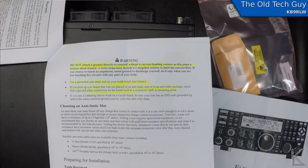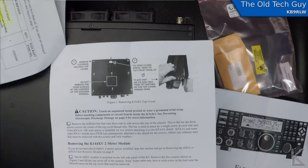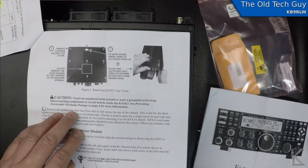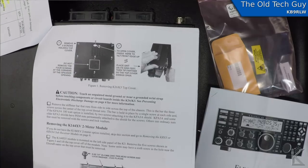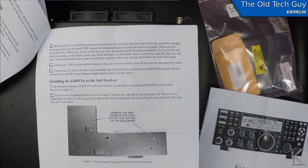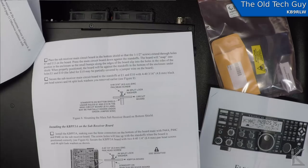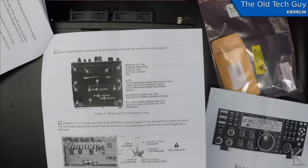To install the general coverage receiver, they give you preliminary ESD stuff — I've got a mat and a wrist strap. They show you pictures of the printed circuit board, then they want you to take off the cover. If you've got optional things like the two meter module installed, there are instructions for removing that. If you've got the optional sub receiver installed, there are extra steps because the filter board goes in the sub receiver itself, but we don't have one on this radio.